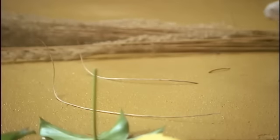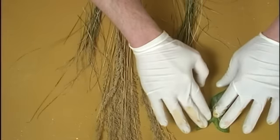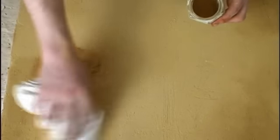You can imprint on your second coat, then wax or lime wash it to give it more reveal. Grass and leaves can be imprinted into the plaster — you have to time it just right so the plaster is not too wet or dry. You can also rub raw powdered pigment into the imprinted areas, wiping off any excess powder and revealing more of the imprint. You can rub powder on any dried plaster to create soft color tones.